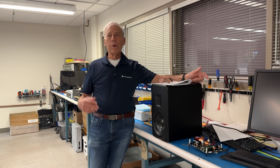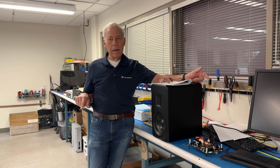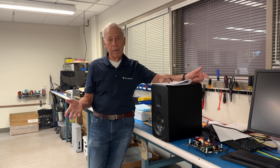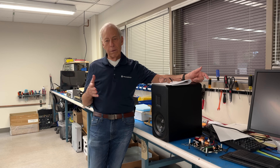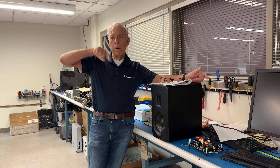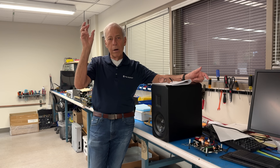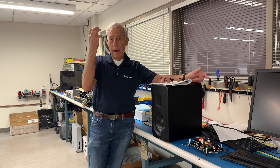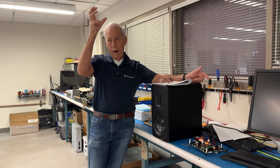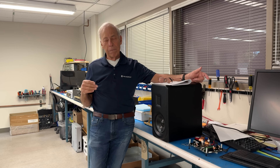What's audiophile quality? Well, you want something that is extremely low impedance and low distortion, especially when the power factor is grabbing power at uneven intervals along the sine wave, like a power amp. Special class AB power amps have fairly low power factors, which means as the sine wave is rising up, the voltage is going up, but we're not drawing any current. Only right at the tip of the sine wave is where we draw current — and we're going to draw it big time, quickly and hugely. So we're going to grab a big slice of power right at the very peak of the sine wave, which causes the flat topping of the sine wave.